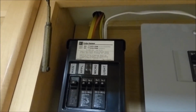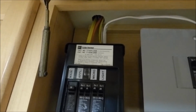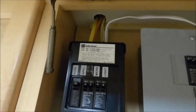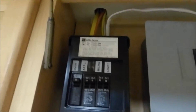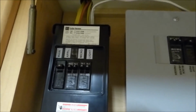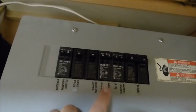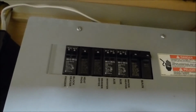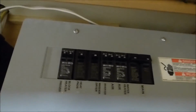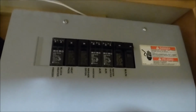When we moved from a 2,000 watt inverter to a 3,000 watt inverter, they actually wanted to switch this down to being either a 40 or 50 amp box. This is a 40 amp maximum box, it says there in the little letters. But the wiring was only capable of doing 30, so we left it that way. Effectively, our inverter can go up to 30 amps. If you try to put too much load through the inverter circuit, it will pop that breaker over there, and if not that, this breaker. So it's very well protected from using too much power.